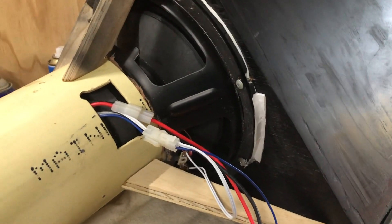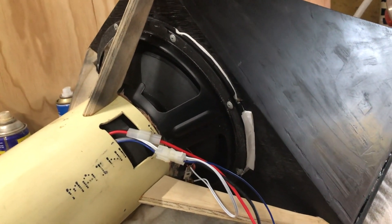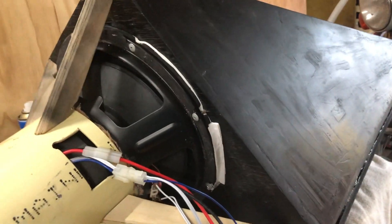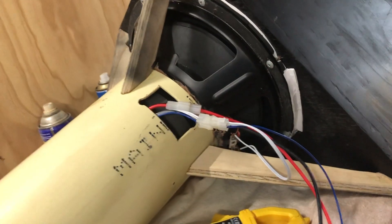After a bit of testing, it does sound pretty good — it sounds probably about the 0.7 Q which I was aiming for with about a 22 litre box. So yeah, I'm pretty happy with the sound; it's not really compromising sound quality for its looks either. I'm pretty happy with that, because the air output confirms it's working all the way through.